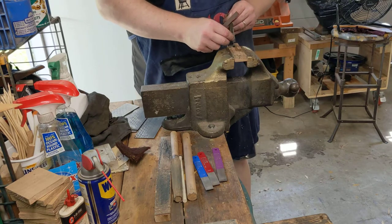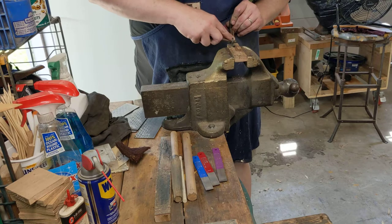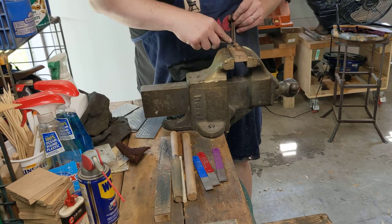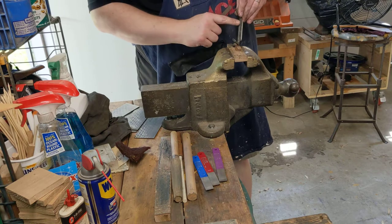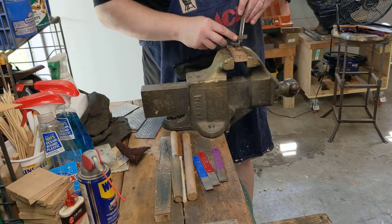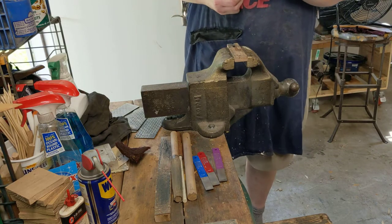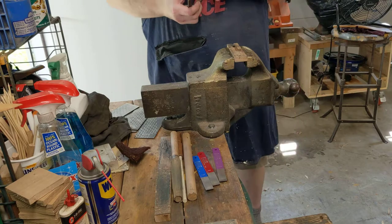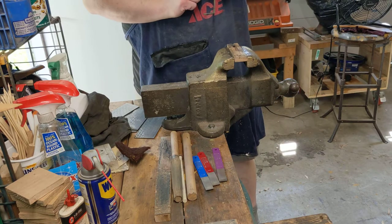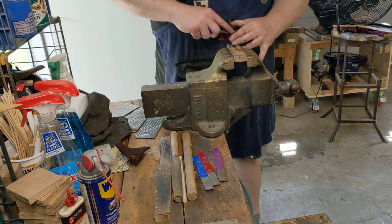And you can see I'll hold this in the wedge. It helps. And I'm just holding this flat. You can actually see the shiny part, that by holding this across here like this, that's setting the bevel. And I've got to sand away that little land I did when I flattened it out like this. I created just this little bit of a flat along there, and I've got to take care of this.